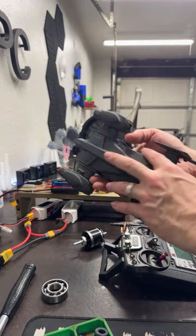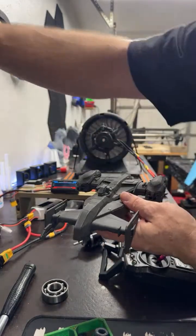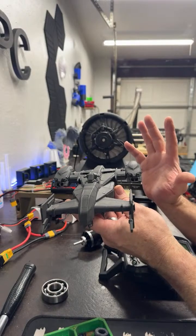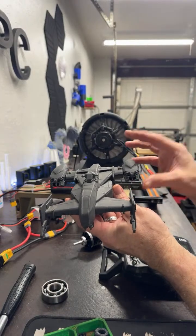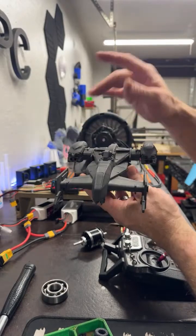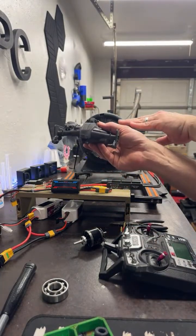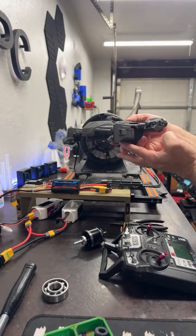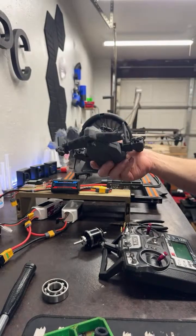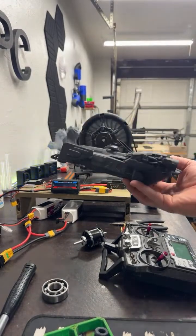And this is one of the other major products. So you'll have 2 large fans for weight mitigation that will run independently, because the TX16S has extra rotational switches on the side. And then once I have that going, I can turn on these, which will be in VTOL mode, so they'll be sitting up. And then these 2 EDFs or props or whatever I decide to put in there will be the other 2 parts of that. And then what's going to end up happening is, as these rotate forward, we're still getting that mitigation of the weight from the back, because the back one will speed up, the front one will slow it down, because these 2 here will be yaw and pitch control. Plus these articulate. I know it sounds like a big project, but it's what I want to do.